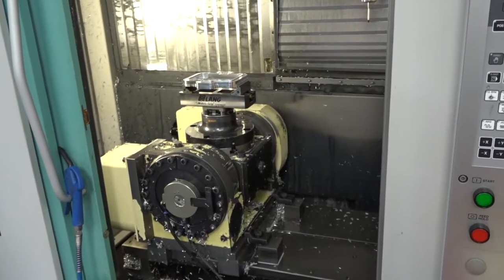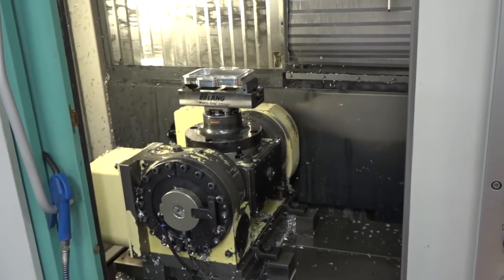The way we looked at it is sometimes it's not all about speed — it's about consistency and overnight running. Because this is partnered up with the System 3R, we don't run it on the limit. We run it with high quality tooling at a comfortable level so it runs all night.